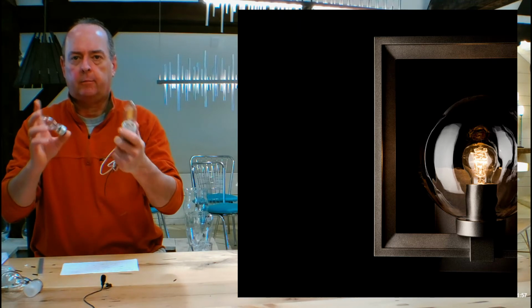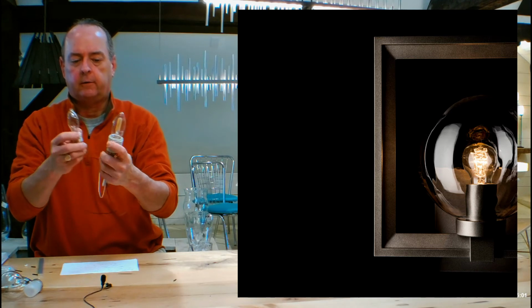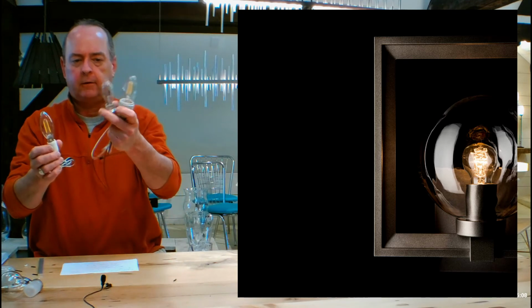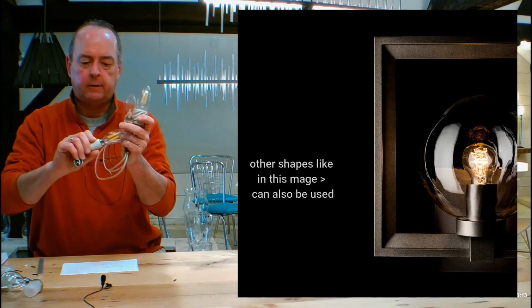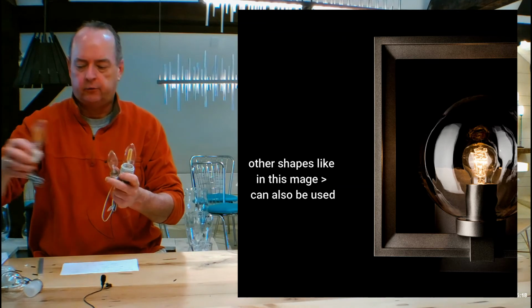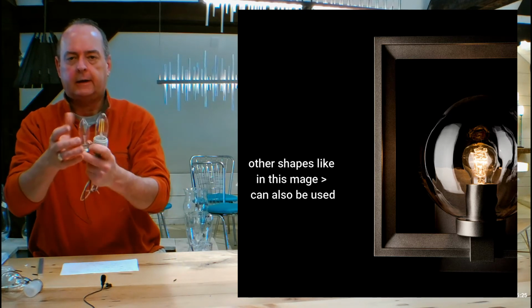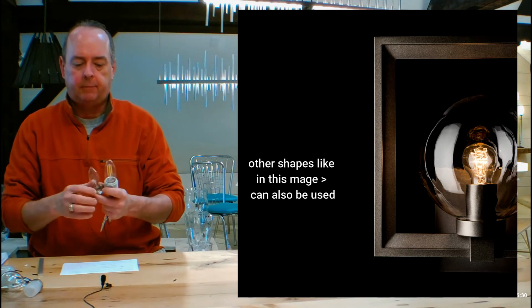It's really the size of the bulb that can get into the mouth of that piece of glass which makes all the difference, and that's going to be these type B bulbs. You guys are used to type Bs being chandelier size because these aren't used in a lot of different applications for the wider base. But you guys have been using these all over the place. These smaller sockets with this kind of torpedo shape, and sometimes a flame tip, like in chandeliers and places like that. But the type B in the equation is really the shape of the bulb getting in, because it's narrow and skinny. It can get up inside that collar, the opening on that piece of glass.